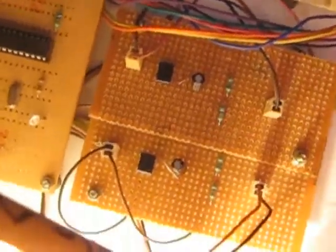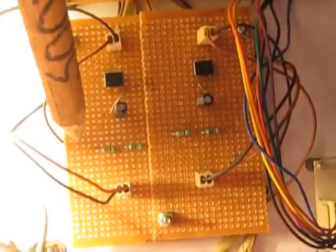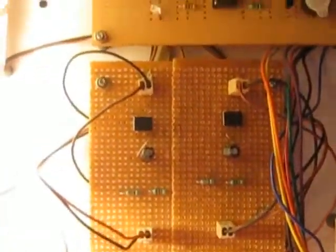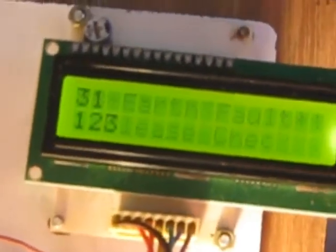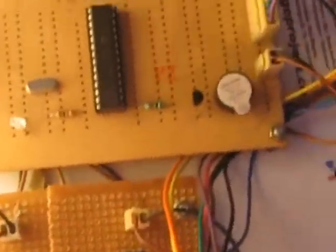Because the current transformer is working in AC, we are converting the AC voltage into DC. And we are using this voltage divider circuit to get only 5 volts of output. This output is coming here, which is connected to the analog-to-digital converter. The LCD is displaying the analog output it is getting from the two current transformers. Here in case of CT1 the value is 125, and for CT2 the value is 30. Now if I switch off the arc fault, then both current transformers are giving the same analog value, that's why it's displaying no arc fault, and the values are nearer to each other — like here we are getting 31 and 35.